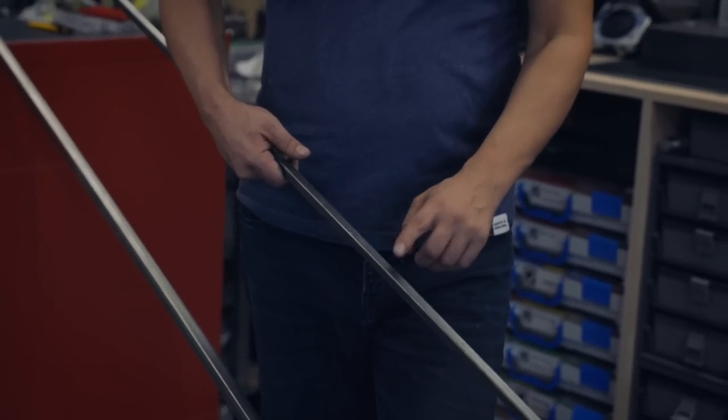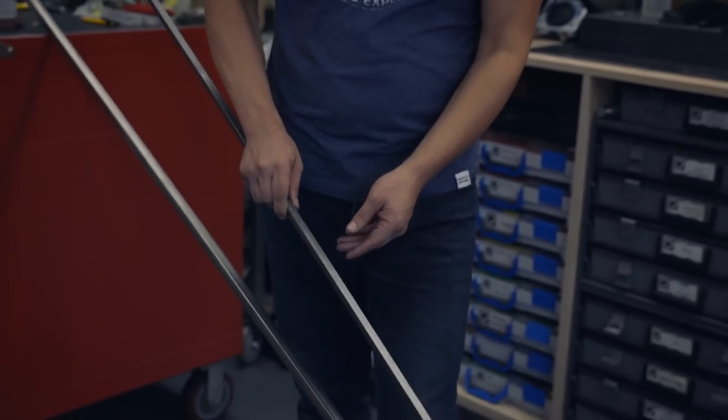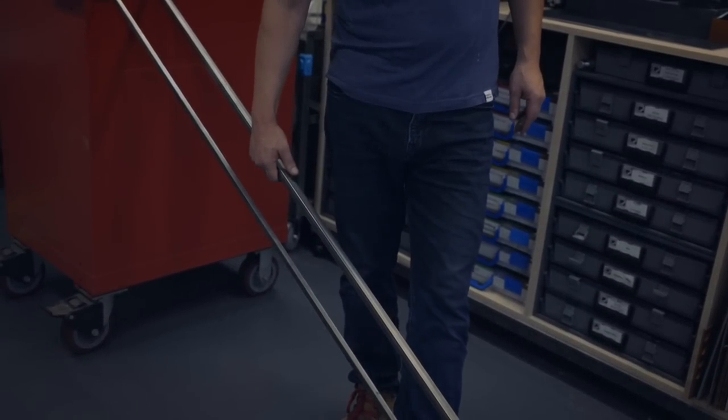Both those tubes are 304 stainless. They're $10 per 20 foot length more expensive than mild steel. With mild steel, we would have to prime it, sand it, prime it, paint it. With this, all we have to do is weld it and put it in there. There's nothing to do with it. It'll last, never rust, never corrode. So clean, low maintenance, that is awesome. And I have enough stainless plate to make all of the brackets and everything else. We'll water jet the brackets out.